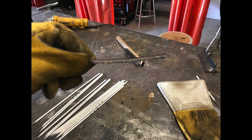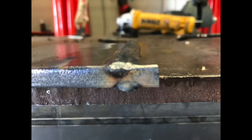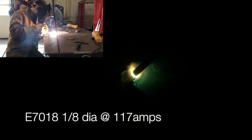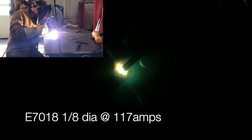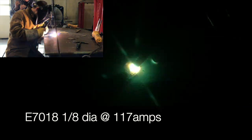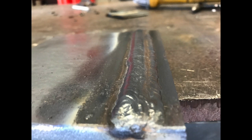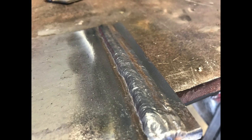The slag had fallen off quite easily — you can just pick it right off. You can see there's no valley between my two beads; it's one consistent dome. Bead number three repeats the same process. You can see I have a little bit of an angle going into the beads, which causes it to lay up over top of the bead before it. The top is nice and flat, but I do have a little wobble in that third bead, so be careful not to let that happen.